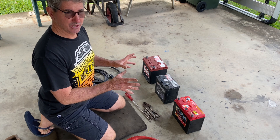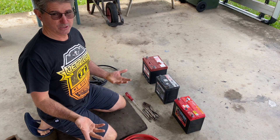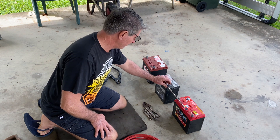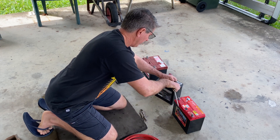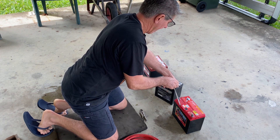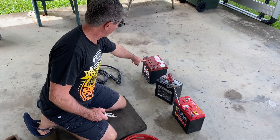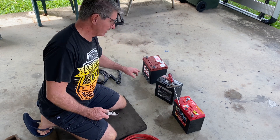You can do it with two batteries, but three will give you a much better weld. Usually if you're traveling in a group you've got more than one set of jumper leads. We've got to connect the three batteries in series to make 36 volts — simply connect positive to negative, positive to negative on that end, and that'll give us our 36 volts.